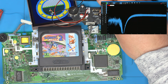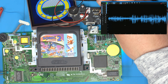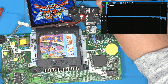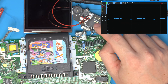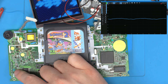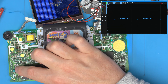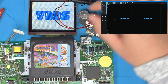We're still getting quite a lot of noise. My suspicion is this inductor — it was never designed to pass high current. If we short that inductor, effectively bypassing it, you can see it works. Let go and you can see the amount of voltage difference. So there are two ways to solve this: one is simply more capacitance on the Clean Amp, which I'll do. The other is including a replacement inductor, because this stock inductor isn't designed to handle dual speakers or the currents involved in powering two 4-ohm speakers.